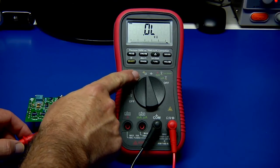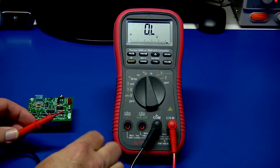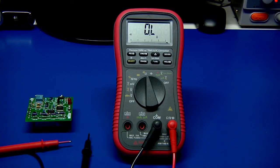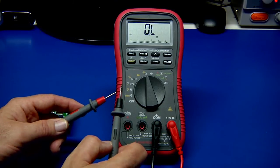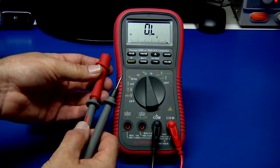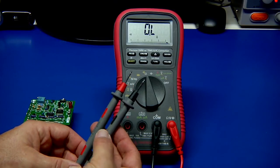There is continuity capability via the select button — the sound is reasonably poor. Switching to the Fluke TL71 probes for comparison, the continuity beep is noticeably cleaner. The Fluke probes are reasonably quick and the sound is better. I'll use the Fluke probes for the rest of the review because I can easily slip on an alligator clip. I bought three sets off eBay at a great price, and they're also CAT 3 and CAT 4 rated — same specifications.